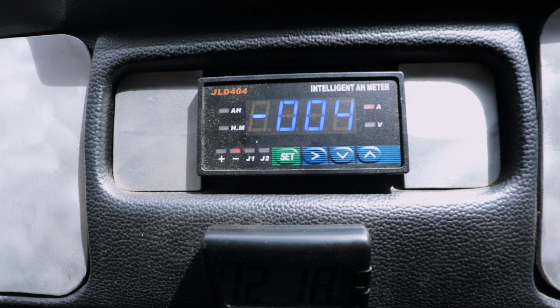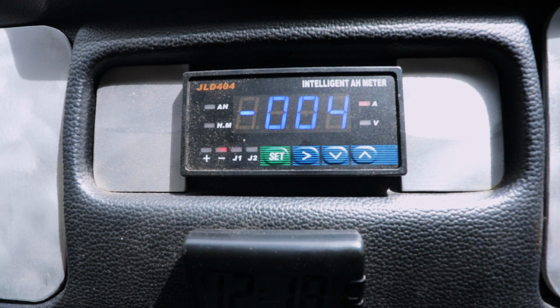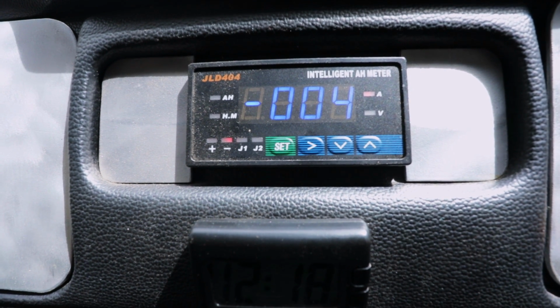In the center there, you can see that's the power coming in. When we're in the full sun, we'll pull up to 8 amps. So that would be times 150 volts, the 1200 watts of the system. So that ends up being 40 to 50 miles in one day pulling out the sun.